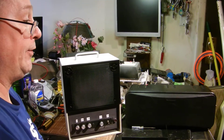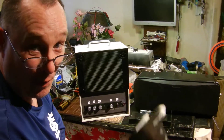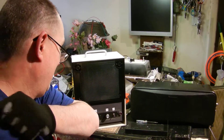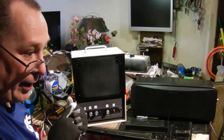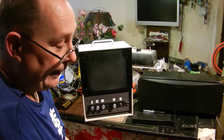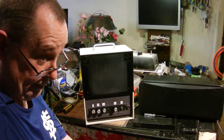I went to test it and got no audio — this went on for like two hours. There's no instructions, but I remembered a thing with an extra wire on the output: you have a red, black, and white wire, and you have to join the red and the black wire for ground and the white wire is your hot. I was flip-flopping stuff, even throwing nine volts through the input. Eventually the problem was a temp quarter-inch jack connector with electrical tape around the base — it was broken inside. Lesson learned: test with your meter first before anything else.